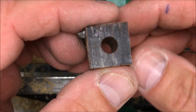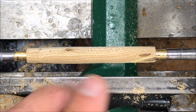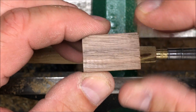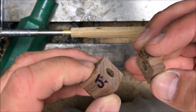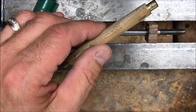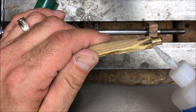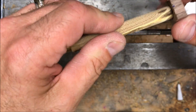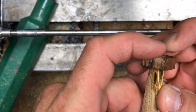What I need to do now is cut this blank and I need to have a perfectly straight cut so that it can butt up against either end of the sagebrush blank. That's going to be the tough part. I'm going to take this to my table saw — I've got a new sled and I'm going to use that sled to hold this blank steady, lock it down and run it through the blade. With my blank cut in half, I've got a nice flat surface on both sides and I'm going to go ahead now and attach that to this blank. I'll put a little CA glue on here, making sure we get some on the wood surface, then slide this piece of wood on here, twist it down tight and hit it with a little bit of activator.